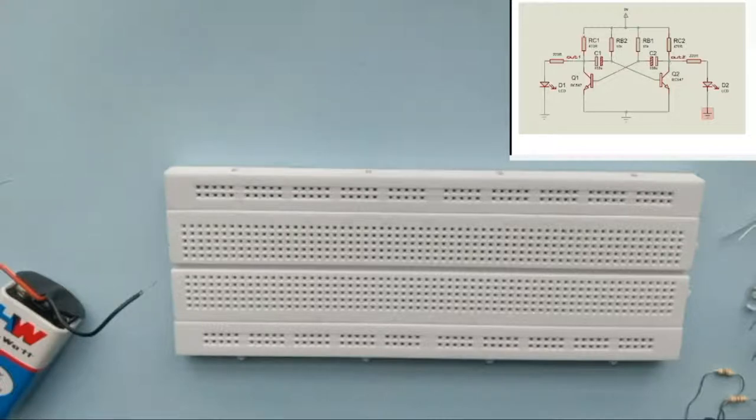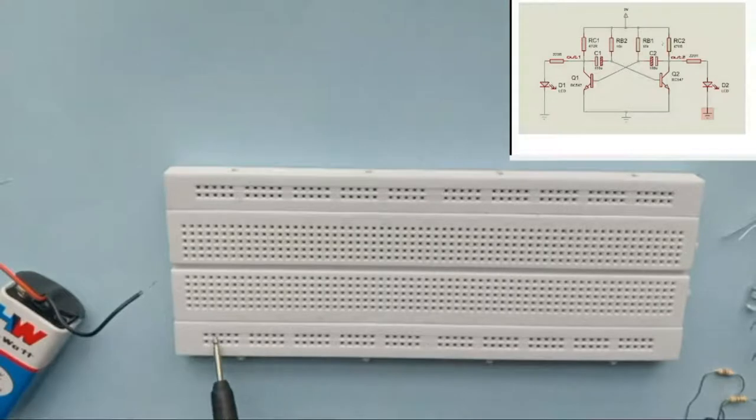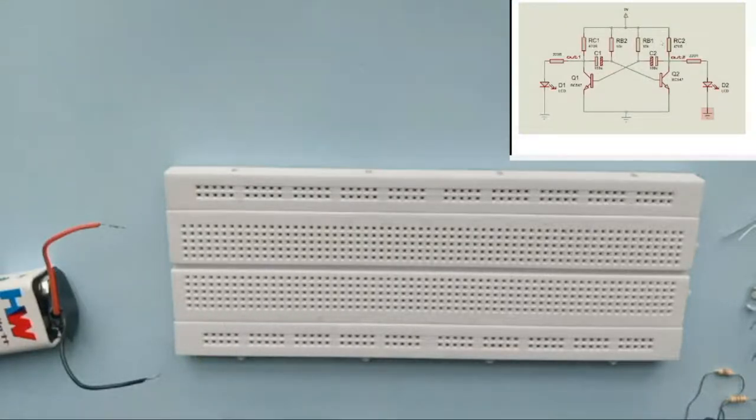It's really my practice not to connect the battery at the start of the design. I connect the battery when all other connections have been done — I think that's the safe approach. So when I'm sure other connections are well connected, then I connect my battery. I'll begin with the resistors. This part of the breadboard is connected horizontally, and I'm going to use this part as my positive supply rail and this as my negative supply rail.